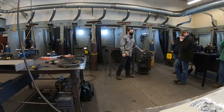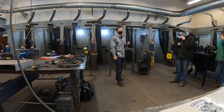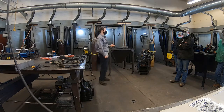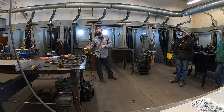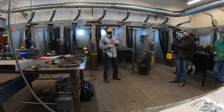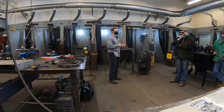This is going to be in regards to carbon arc cutting. You guys haven't done any carbon arc cutting yet — it's considered a fact that you guys are first years. Essentially, the definition of carbon arc cutting is actually the complete opposite of stick welding. With stick welding, we take the filler metal from the rod and melt it onto the plate. Carbon arc cutting is exactly the opposite — instead of putting weld onto the plate, you're actually taking whatever is in front of it off.